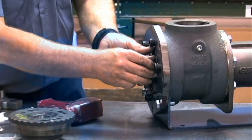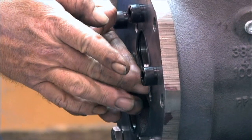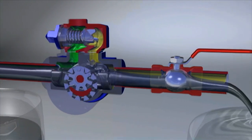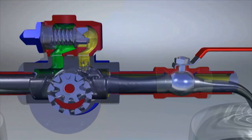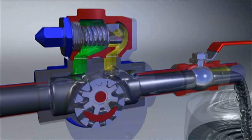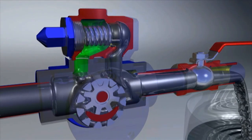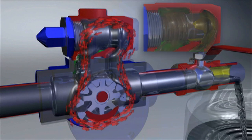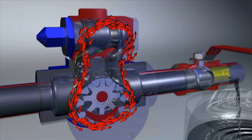The o-ring design on the relief valve allows for adjustment during operation without leakage. If the piping becomes restricted or clogged, the pressure relief valve is designed to reduce the pressure by recirculating the liquid. As the pressure increases, the poppet is cracked open to allow the liquid to recirculate until the pressure is relieved. The valve returns to the normal operating position until needed again.